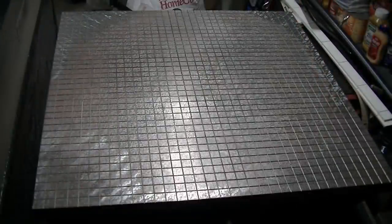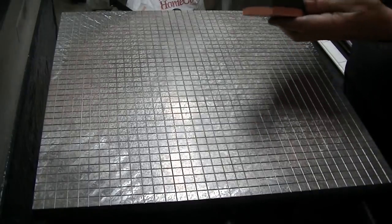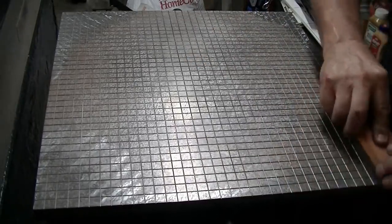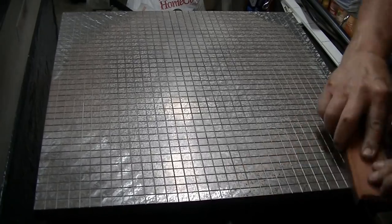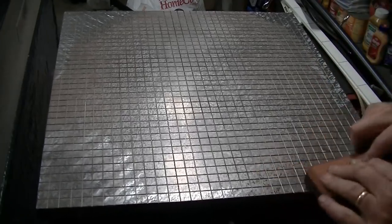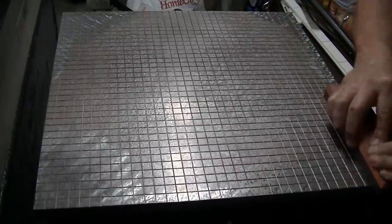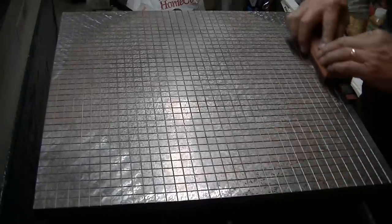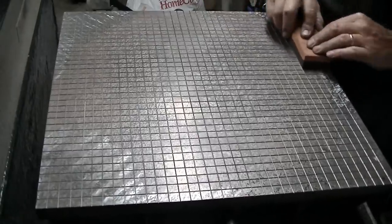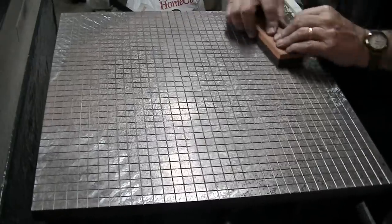That really helps. I'm going to give this a good stoning with the coarse side of the precision ground flat stones. I'm using an 8-inch pair here because that helps bridge and sort of flatten in the process. So by using this vigorously, meaning I'm actually bearing down trying to remove things, I'm inherently knocking down peaks that would cause just a point hit. And I'm getting rid of those. What I'm doing there is saving multiple passes of trying on here. Because the flat stone is so straight, I can lean on this without fear of digging a hole or messing up the geometry.